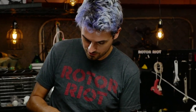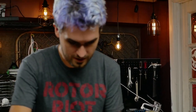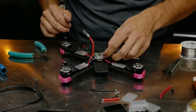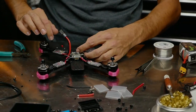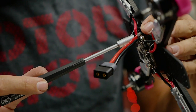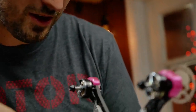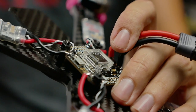We've got all four motors and ESCs hooked up to the flight board. Let's give it one more plug-in test. Looking good! Now that the soldering at the corners is done, it's a good time to put on the nylon nuts that actually hold down the flight board. I didn't do that earlier so I'd have more room to work the corners without risking melting the nylon pieces. When tightening, snug them just enough to put the rubber grommets under a little compression — don't squish them too badly.